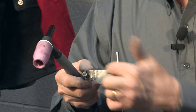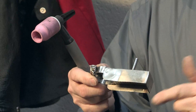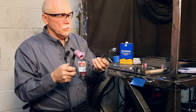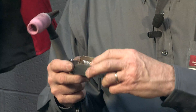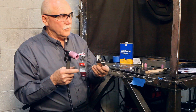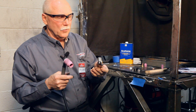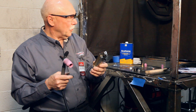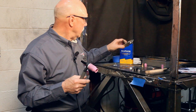These are made in contours for when you're welding on a radius, and they're made for corners when you're welding into a fillet weld — they come in many configurations. You can buy these or fabricate them yourself. Just a caution: these are stainless, with stainless mesh, stainless wool, and stainless lines. When you go to find all this stuff in stainless, it's difficult to buy in small quantities. Sometimes these seem expensive, but they're pretty economical once you factor in the cost of making them yourself and the time involved.